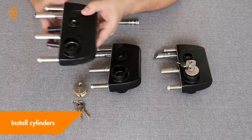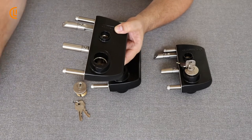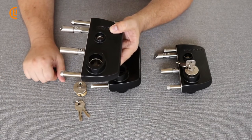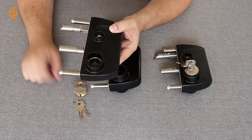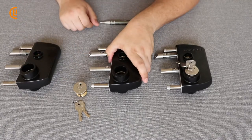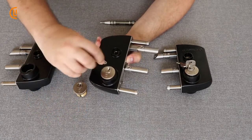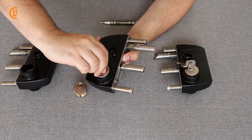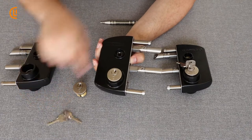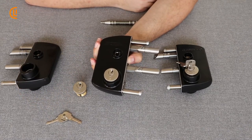This is how it's actually going to look right out of the box. We're going to remove the bolt cover caps that are over our deadbolts, and you'll find that the deadbolt is currently in the retractor position — but we're going to need that extended. We've started one of these in the process here; we've got one cylinder already put in finger tight so that we can get the deadbolt extended and everything is in the correct position so we can line everything up for timing purposes.